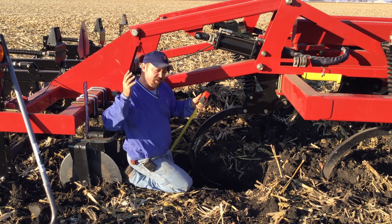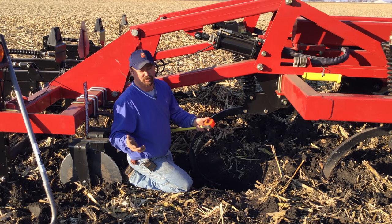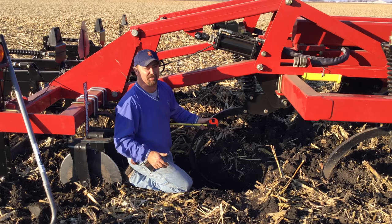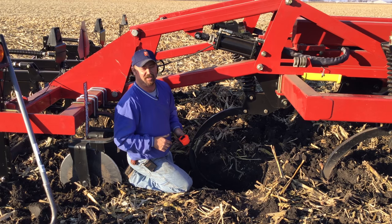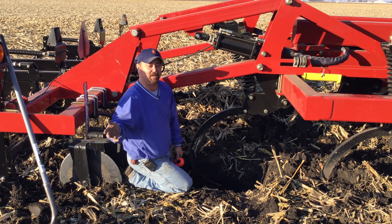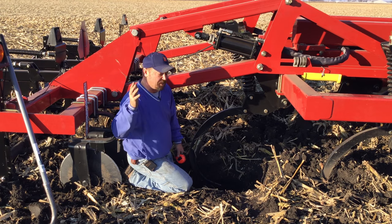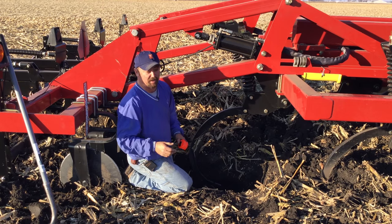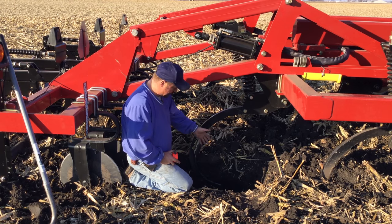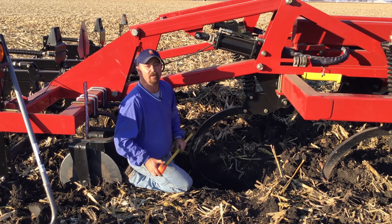If I've got enough horsepower I'd probably go just a little bit deeper to know I'm getting that lift and fracture and removing that soil density layer. But we've got to do enough checks in the field to know where that layer is. Sometimes a field just doesn't have much of a soil density layer, so all you need is mixing. In a conventional tillage situation you don't need to bury this thing 14, 15, or 16 inches — that's unnecessary, and on a lot of farms going that deep could hit tile line. There's no sense burning fuel and adding wear and tear when you don't have to. Know where your compaction layers are, know how deep you have to go. Just a tape measure, a soil probe, and a shovel and we can get the job done pretty quick.